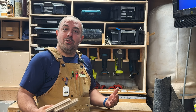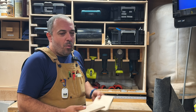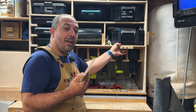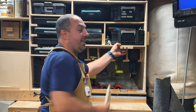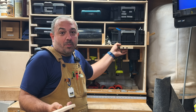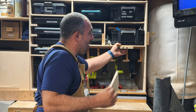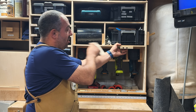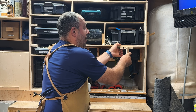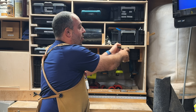In this head-to-head versus showdown for my wooden tool holder, I want something that is adjustable. This old one I have here doesn't work for me anymore. We're going to replace it with a new adjustable system where we take a top plate and use a keyhole router bit. The keyhole router bit makes a T-groove inside the wood — basically a T-track built into it. These router bits are really cheap, about $10 for a pack on Amazon. I'll do a keyhole every inch all across the top, and my dividers I'll run through the table saw to put a groove on both sides to make a T as well, so I can just slide them right in. I buy a new tool that's bigger — I slide it out and move it over one slot.